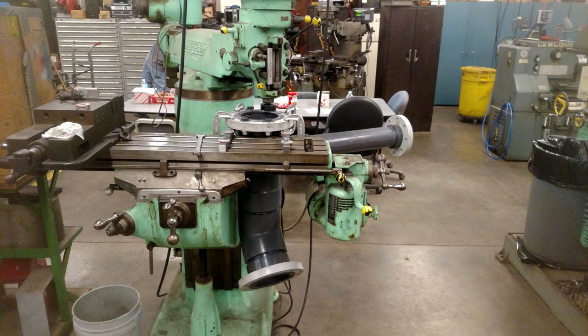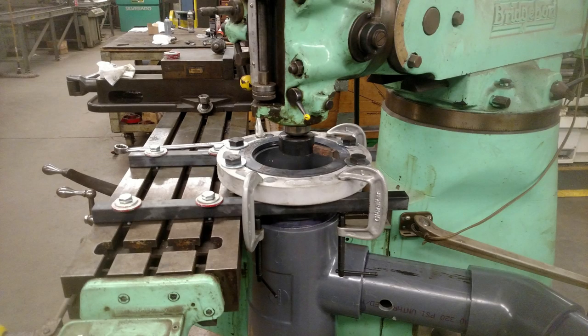This took a little bit of experimenting because I needed to make sure that I could travel all the way in one direction without the plastic pipe hitting the knee of the mill. Basically my only option was to put a couple of bars on there that I could clamp the piece to, and I just drilled holes through the bars to match the spacing of the T-slots on the table. I used some bolts and wide washers to clamp the outer ring to the middle section just to keep it all stationary, and afterwards I had to move those bolts over a couple of holes so that I could machine the rest of it.